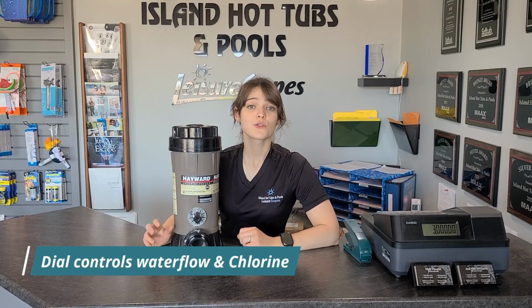So on your chlorinator, there's going to be a little dial, and this goes from 0 to 8. This is going to depend on your chlorine demand in the water. So if you have a really hot day or you have a lot of people in your pool, then you may need to set it a little higher than what you usually set it for. Usually a 3 to a 4 is a good reading, but until you start getting used to and getting comfortable with your pool, then you'll just have to monitor this.